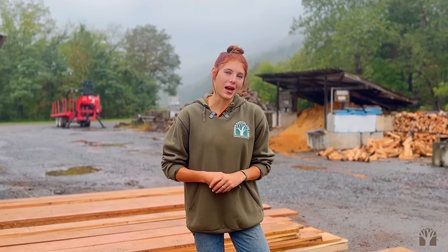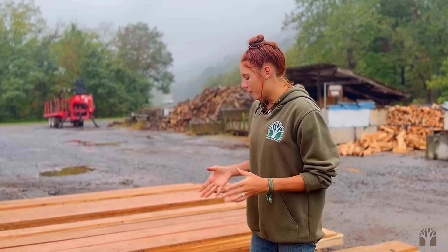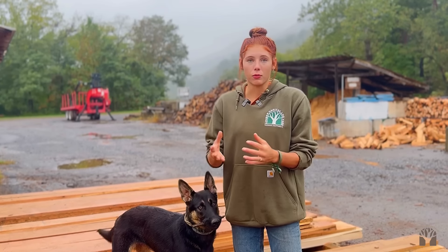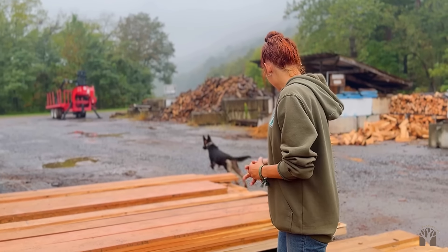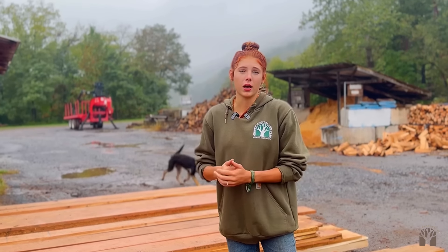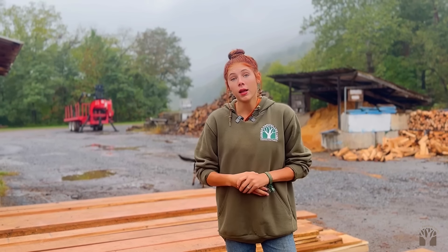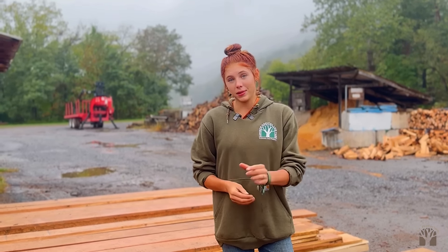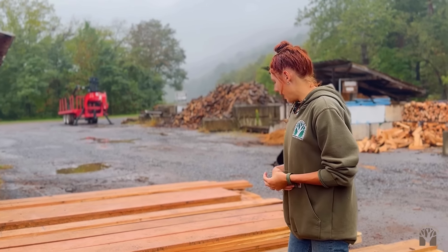Bingamins will buy the clear white oak and red oak for what we think is a good price, so we sell that to them. They've come out and helped us understand what they look for when they sort through our lumber. As I'm putting boards through the edger, I'm watching carefully to get the nicest board out of each piece - if there's a knot on one side and I can edge that off, it's better to lose two inches on a board if it means it's then clear.